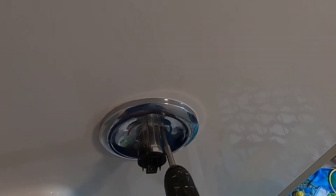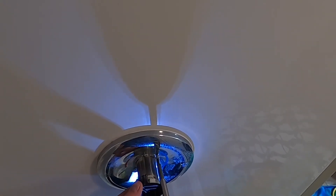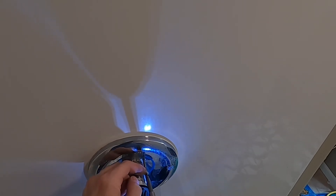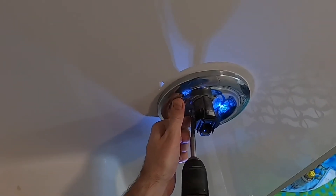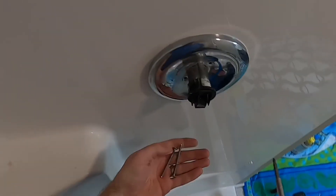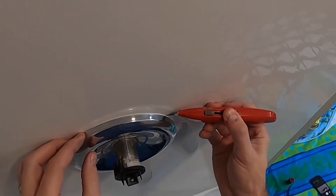Now we're going to take out the plate — there are two really long screws holding it in. You could take out the plastic parts first; there are three plastic parts to back out. But I chose to take out the escutcheon screws first. You can see me backing those out — pretty simple, I used my drill, though you could use a really long screwdriver. Those screws are quite long. If the plate doesn't loosen up, there might be a line of caulking you'll need to cut with a utility knife all the way around.